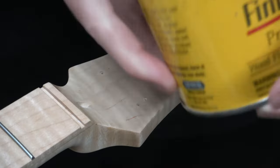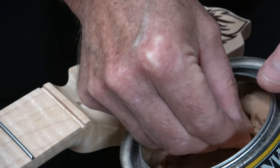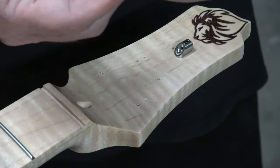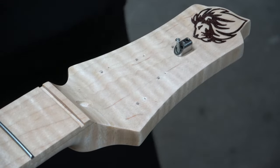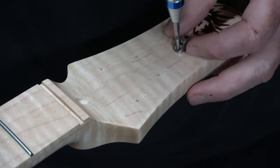Here's a tip for preventing those tiny little screws from breaking as you install them: scrape the threads against a bar of soap, a candle, or pack the threads with some paste furniture wax. That will lubricate the threads and make it a lot easier to install them without worrying about snapping off those tiny little heads.